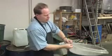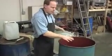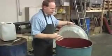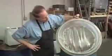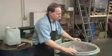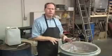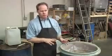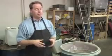However, when we go out and collect oil, we'll bring a barrel back here, bring it right to about here, and then we'll get out a filter. And this looks nice and kind of grimy. It's a 400 micron barrel filter. We put it on top of the barrel, and then we filter the oil. Once our filtered oil is done, we're going to haul it into our production facility, which we'll show you in a moment, and we make the biodiesel.